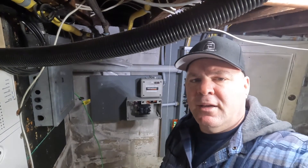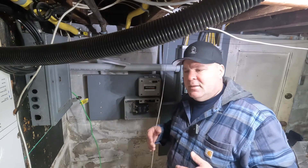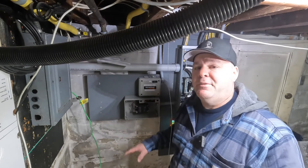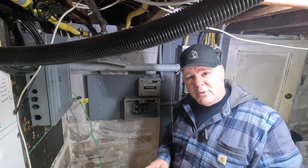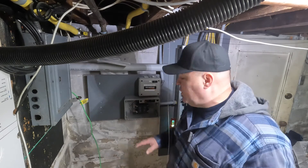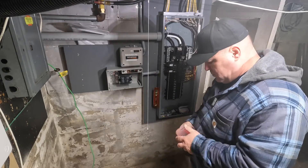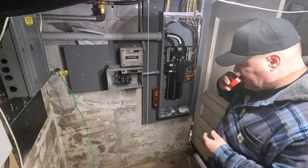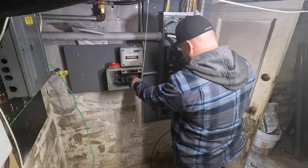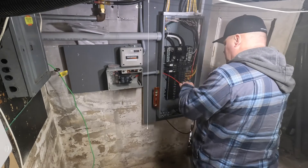Now let's get some conductors and wire up this smart manage module. The way this works is it operates on frequency. The smart guts in here actually measure the frequency — in Hertz — of the electricity being delivered from the generator. If it's not up to 60 Hertz or somewhere in that range, and the generator is not running like it should, it'll lock this load out so it won't damage the generator when it's trying to start up. To avoid confusion, I identified my load conductors in red and my line conductors in black. I fished four number six conductors through this nipple chase here to the smart manage module and made my connections.